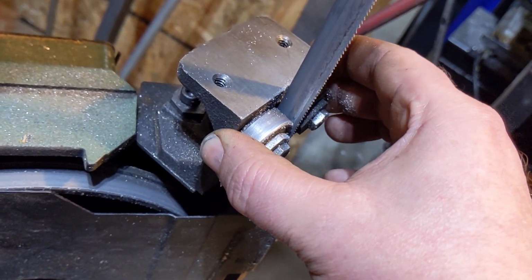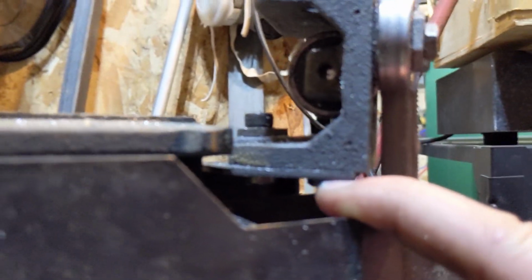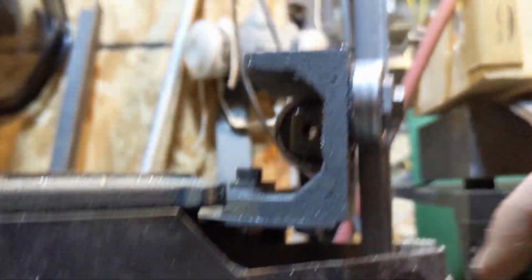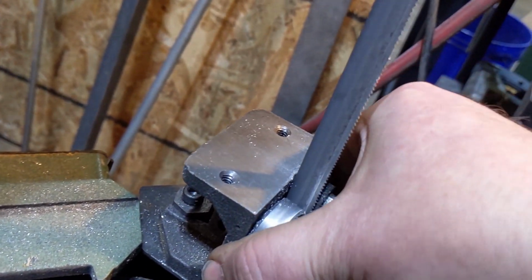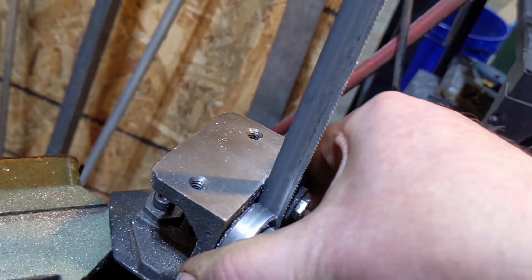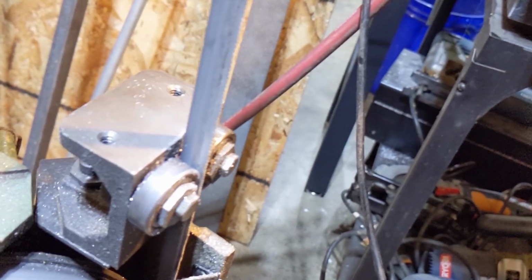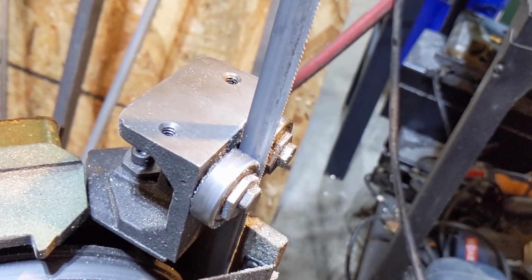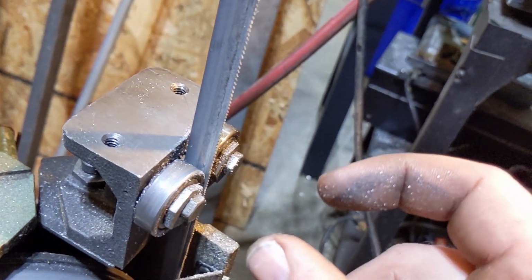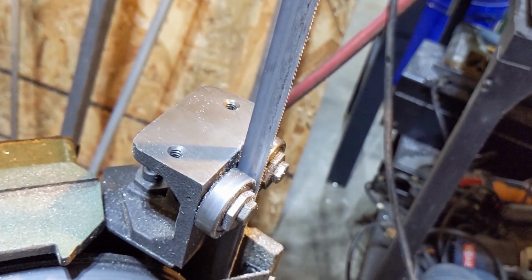So I either need to notch the casting out so that the bolt can sit down to where it originally sat, or do something else. I don't know. Maybe I'm almost even thinking about resorting to cutting that with a hacksaw, but I'm not very good with a hacksaw. Yeah, I'm 3 yaks deep. All I really want to do is get a round piece of brass and bore a hole and secure it in there so that I can cut the bearing seat.